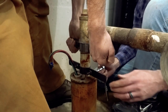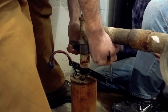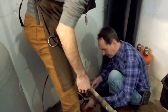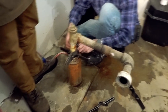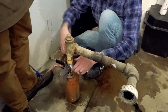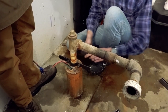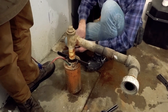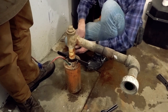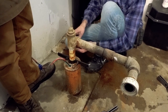Let go easy and see if it stays. I'm gonna put this clamp on, then put the second clamp on above it, 90 degrees off. I didn't know what size the pipe would be because I couldn't see it, so I got two different size clamps — they cost two bucks. I didn't want to end up in a situation where the water was off, the pipes were cut apart, and we couldn't do the job.